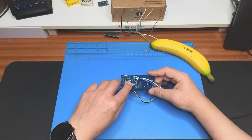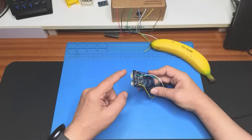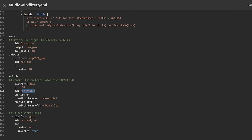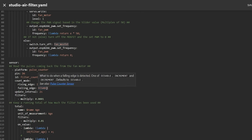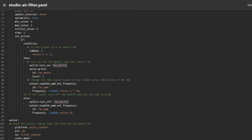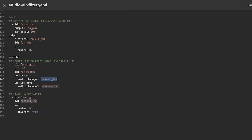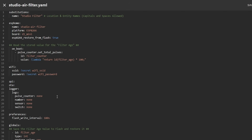To finish off, the servo component is all set up for you. D2 on the D1 Mini is the white wire going to R13, which controls the MOSFET which in turn controls the 24 volts to the fan. That switch gets turned on when the value is one or above, otherwise it turns off - that's 'fan_mosfet'. When the switch turns on it turns on the onboard LED, and when it turns off it turns off the LED. I hope that makes sense - you don't really need to worry about any of this because I've done all the work for you.